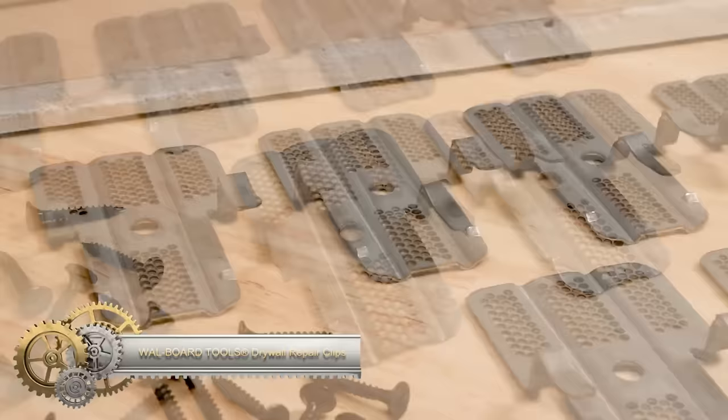The EDMA Portadol is an innovative portable slab carrier tailored for the transportation of concrete or wooden slabs up to 25kg. This versatile tool is adjustable, accommodating slabs ranging from 280 to 665mm in width. Standout features include its central carrying handle for easy maneuverability, steel jaws lined with rubber pads for secure grip, and a design that's simple to assemble or disassemble. To utilize, adjust the width, position the slab between the jaws, and lift using the central handle. Wear protective glasses and avoid overloading.